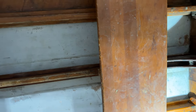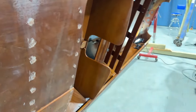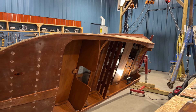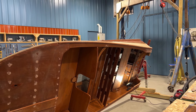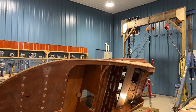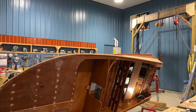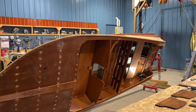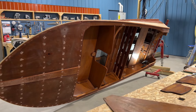That's why this area gets a good paint versus varnish. Then I'll start to use my 3M medium steel wool pads — they come in pads or sheets — and I'll literally scuff the entire surface of the interior. Where I see areas like on the inner keel or keelsons that are chipped through the varnish, I'll hit that with 80 grit because it's chipped enough to sand down to good wood, then restain it or even leave it natural, whichever looks better, and reseal with Pettit high build varnish to beef that up. That area gets a lot of traffic — it's where passengers step — so there's no floor; that's the floor.